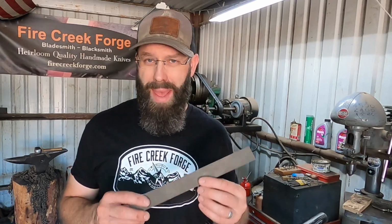from a stainless steel. Now, I've worked with a couple of different stainless steels in the past, specifically AEBL and S35VN. Both of these steels do not require a cryogenic treatment within the heat treating process. They do require a sub-zero process, and that is accomplished with a dry ice slurry without the need for liquid nitrogen to attain the cryogenic temperatures. From what I've read and researched on MagnaCut, it doesn't necessarily even require a sub-zero treatment in the heat treat process. There are different ways to accomplish the finished hardness and properties of this steel from what I've seen, and that has to do with different austenitizing temperatures and the corresponding tempering temperatures and this kind of thing.